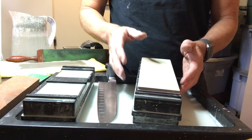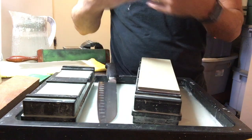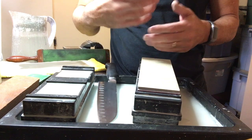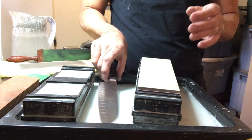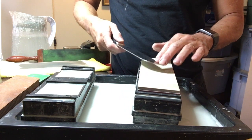And you've seen videos on how I sharpen before, so this one's more on how I deburr. But the way I deburr, it's a process that's unfolding all the time as I sharpen. So anyway, the burr, as you know, forms as we sharpen.